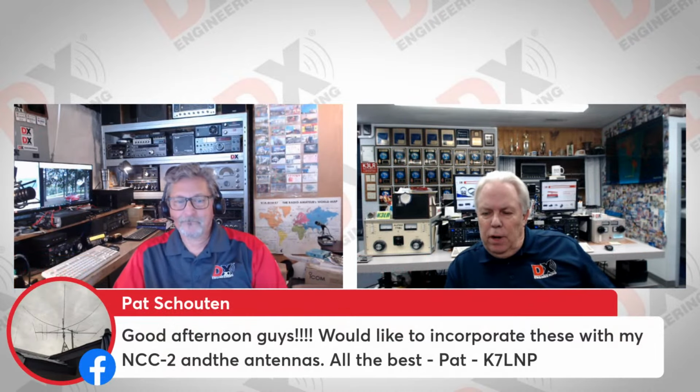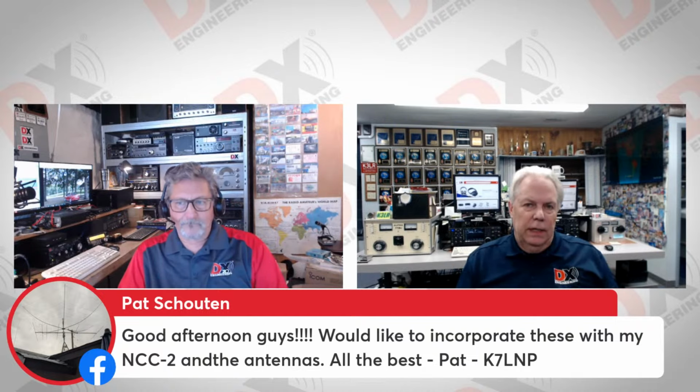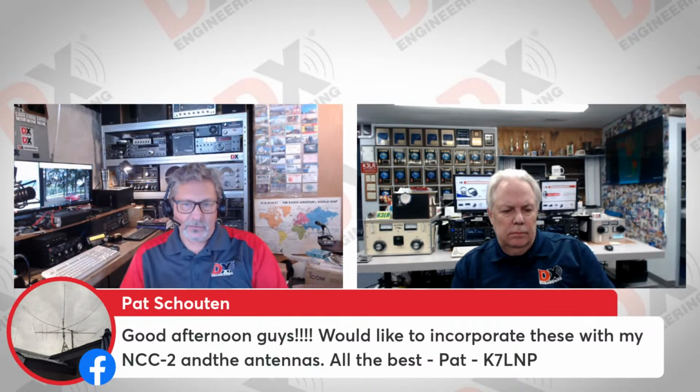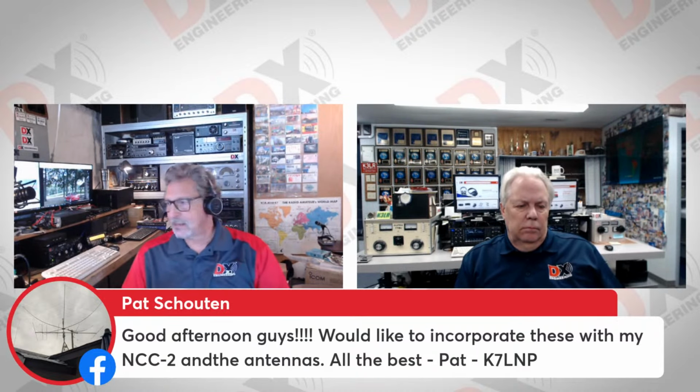Pat is on here in the chat room, K7LNP, and he said he would like to incorporate these with his NCC2 and the antennas. And Pat, that is a great idea. Again, to provide all the isolation possible to keep the shield being a shield, and, Rod, keeping the noise off the shield. Yeah, it's a key ingredient to a really low noise receive system. These receive chokes are now very affordable, so you can have them in multiple positions in the system, and it's not going to break the bank.